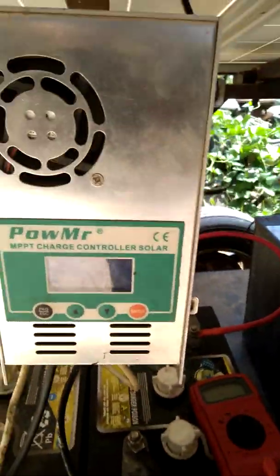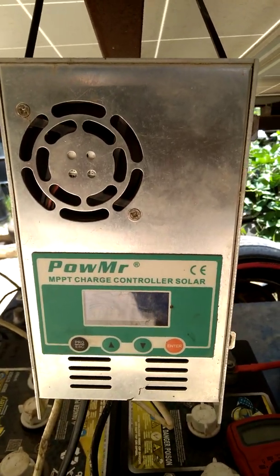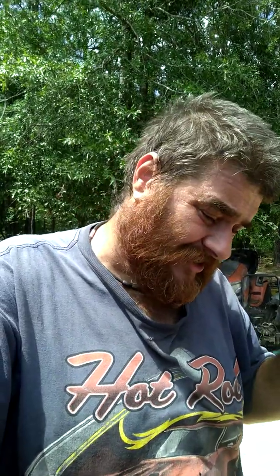As we go, I'll shoot more video. I am going to buy a better quality charge controller — this is just a spare I had. I'm looking at one that's probably about $300 to put on here. Will it work any better? Honestly, I couldn't tell you, because right now this thing is working really well. The reason I'm putting a new one on: I've got a new 60 amp breaker, a new combiner box, a brand new inverter, and new batteries going on this. The panels were new a couple years ago even though they haven't been used, so that's why I'm putting a new charge controller on it.